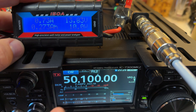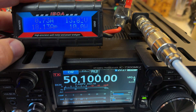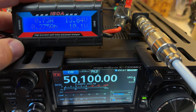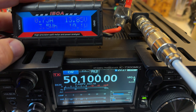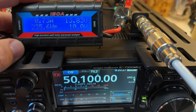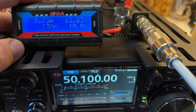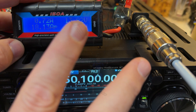This is a nice low power figure. I know there are radios that do less, but they're QRP — my IC-705 will draw even less, but I'm limited to 10 watts. I'm just trying to see what to expect in the field. If I'm in my pickup truck with a 260 amp-hour battery that's recently fully charged, who cares. But if I'm on day 10 of a 12-day outing and down to the last dregs of my battery, I want to know how much play time I have left. That's all — catch you on the next one. 73.